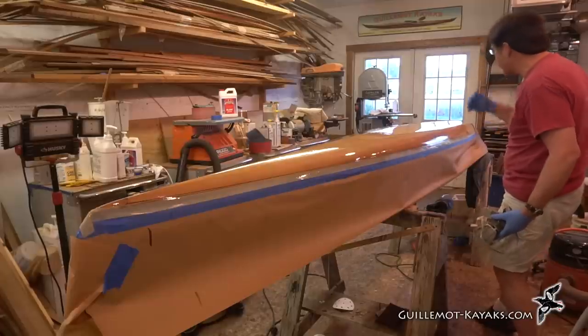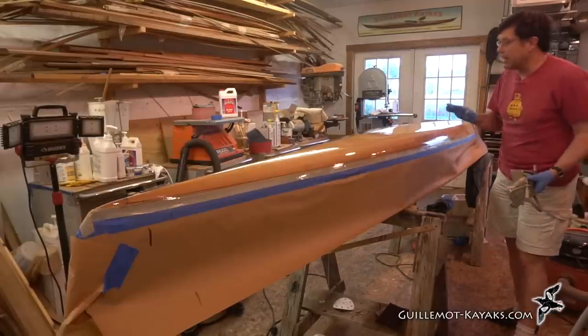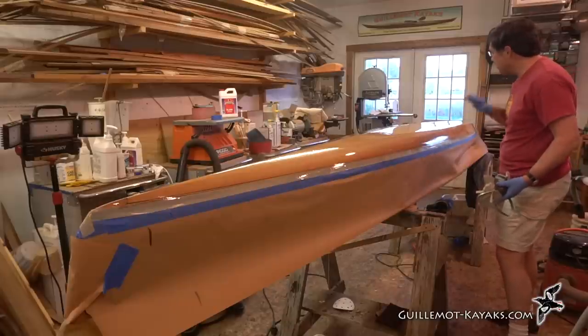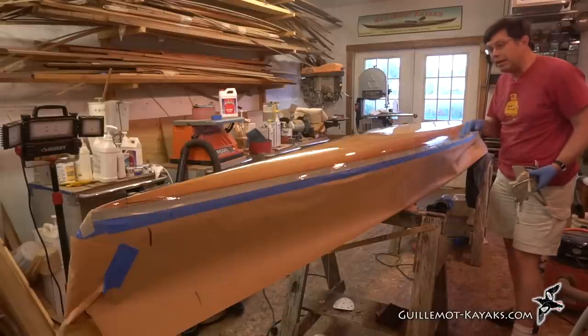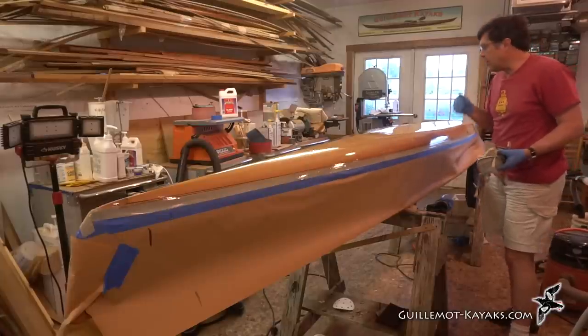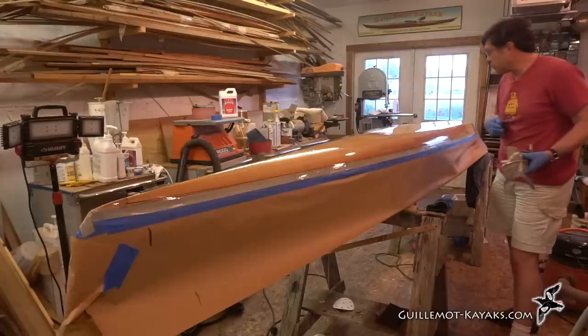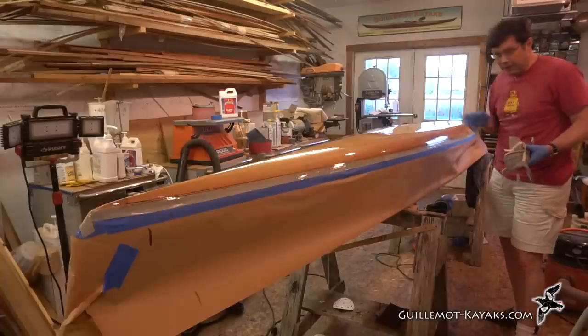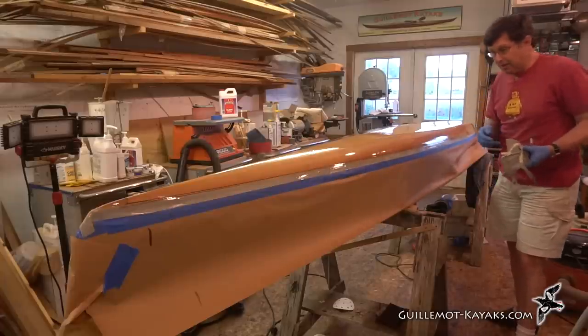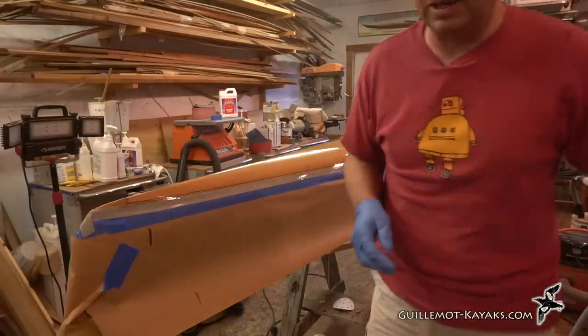I've got some sags. This isn't acceptable as far as a final product, but again, I think I've got sufficient build here. I can level this out and then either very carefully brush on a final coat after that, or I can try my rattle can spray stuff. So I'm gonna peel the tape off, open the doors, let the stench out. It's really bad smelling stuff.